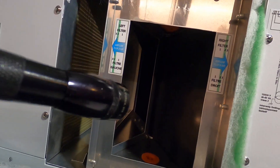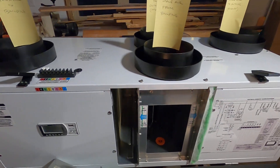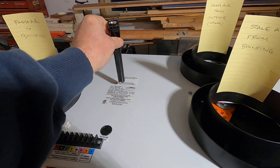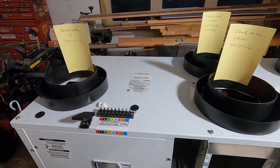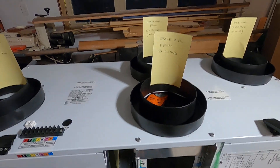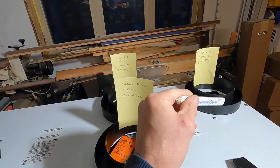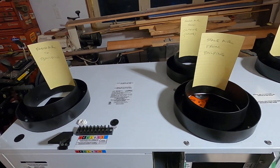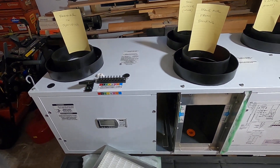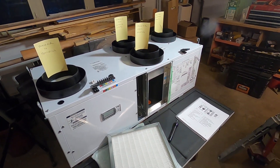This machine actually has a second mode. There's a heat pump unit right about here in the box, so you can also run it in heat pump heating mode or cooling mode, where you take fresh air from outside, pass it through, extract the heat or push heat into it from the heat pump, and circulate it through to heat or cool the building. So it's a dual-mode device — a little different than many — but there you have it.